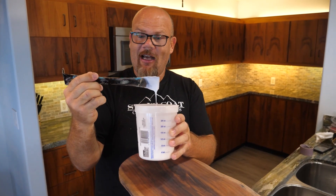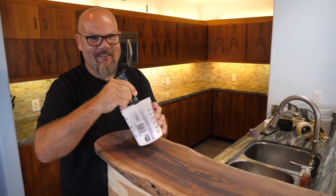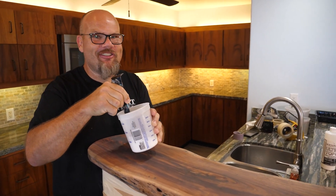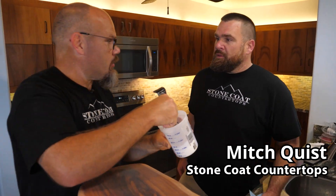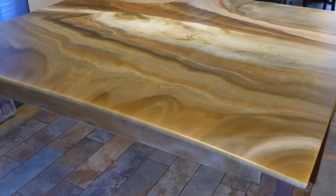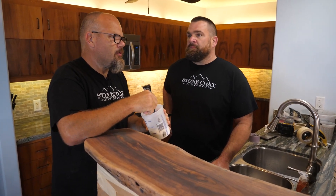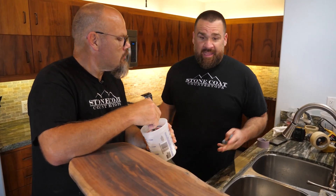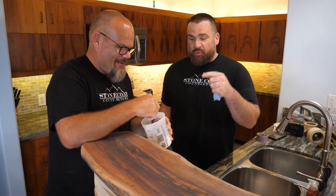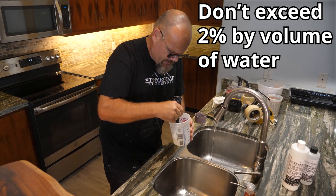I'm improvising with a flat bar from my toolbox as a stir stick — punch perfectionism in the face and let's get this done. I'll mix for about two minutes, then add a little bit of water to thin it down to the consistency I like. Mitch, you've used this Ultimate Top Coat on a lot of pieces — yeah, on a bunch of pieces including Ken's kitchen and it looked fantastic. Durability is key in a kitchen — the biggest question we get is can I set hot pots on my granite, and yes, you can set hot pots directly on the Ultimate Top Coat once cured.